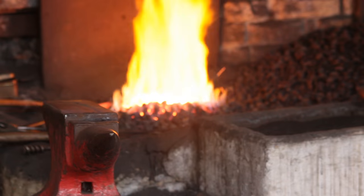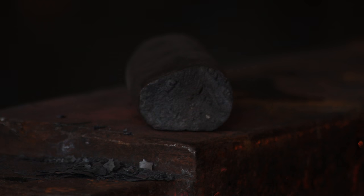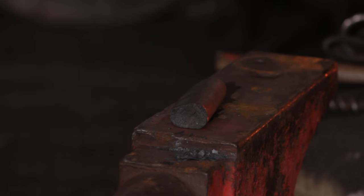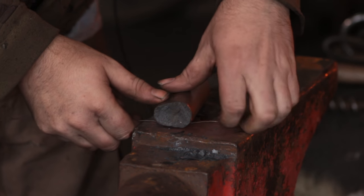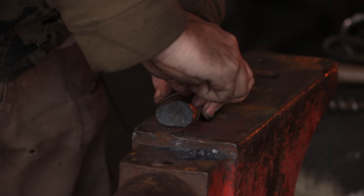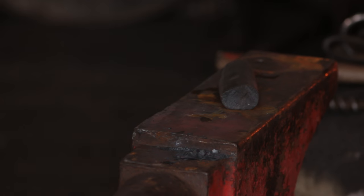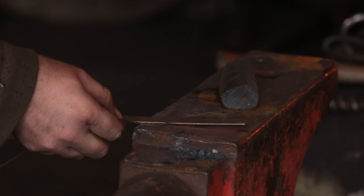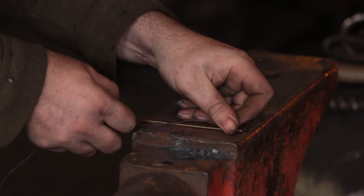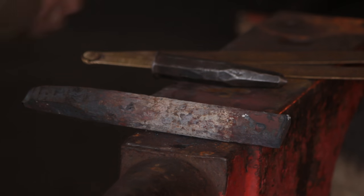I gave it a quick buzz with the linisher, which I didn't record because the battery was dying on my camera so I had to be quite selective with shots. Once linished, I got a piece of wire and wrapped it around the mandrel to get the external diameter at the widest point. That measured up to five inches, which means the parent material for the eye needs to be five inches long plus twice the thickness of the material.